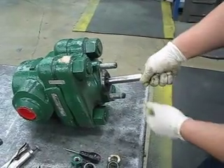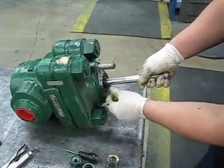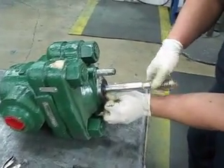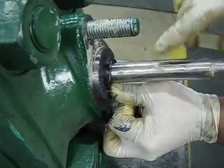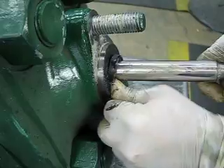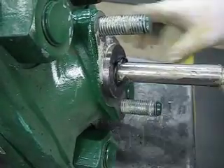Pull the stem all the way back if you need to. Kind of move it a little bit to work the packing in there. What I usually do is kind of move it to the side, push to one side, make sure that it's in the ID, and then kind of go down with it — work it all the way around just like that, both sides.